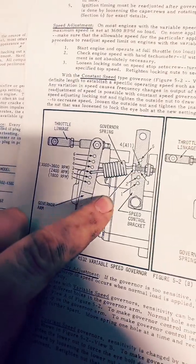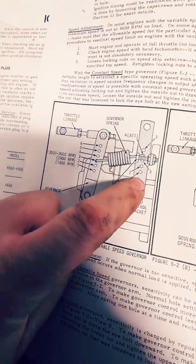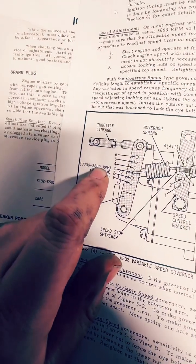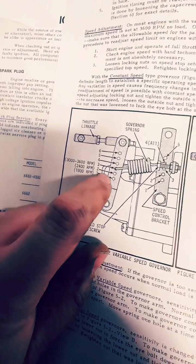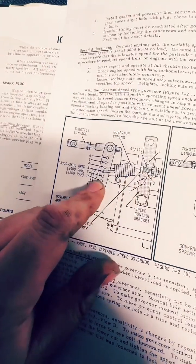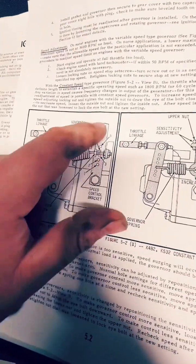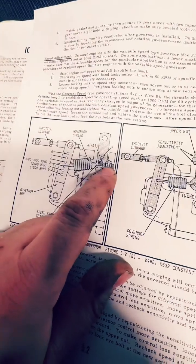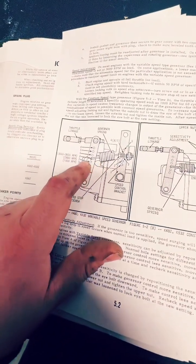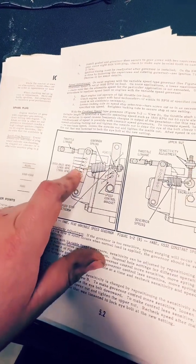You can see here they give you a standard setup to show you what RPMs you're running and what you're limiting yourself to. This Bobcat calls for a 3200 RPM max. I was actually down at 2400, so we went ahead and moved it up to positions three and four. Then we adjusted the speed bracket and moved the screw until we were running about 3150. In the next video, you can see it go from 850 to 3150 to confirm the carburetor is dialed in and the governor is set correctly.